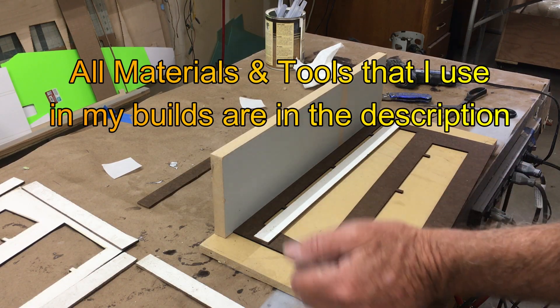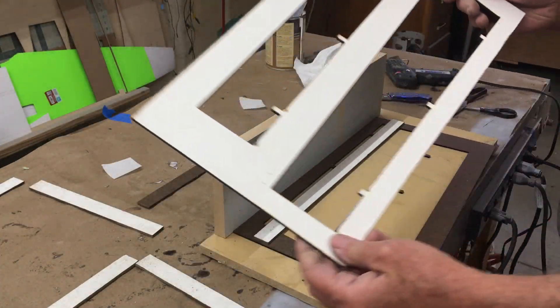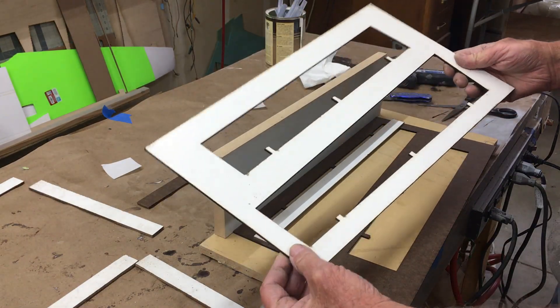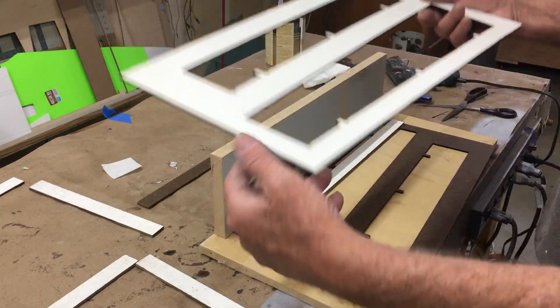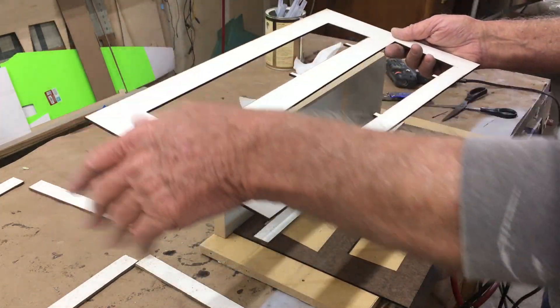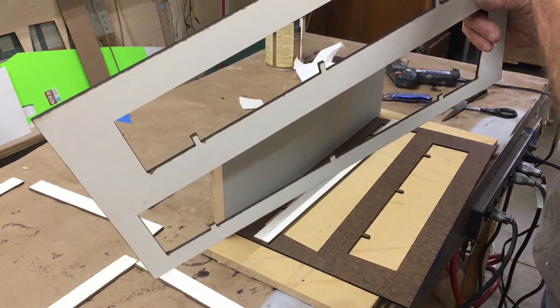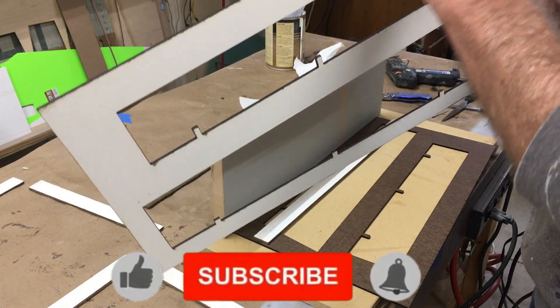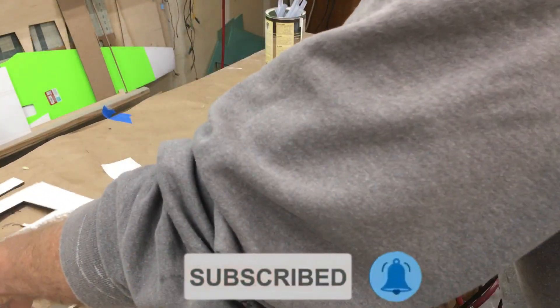These are parting planes — I think we'd probably call them a box-type parting plane. This is a standard parting plane. The way I did the wings was basically I built that frame, popped on the wing plug, and just laid it up. So basically the wing mold comes out with flat sides — this is going to have a box-type look, and this is how I do it.